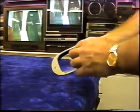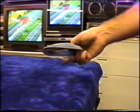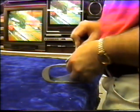And of course, I'll use the same Dremel tool and just Dremel out these areas. Now, I always have to be careful when I go through this plywood, so I can slit this with a zona saw first, so that it'll break out in one nice, neat piece. If you don't cut that plywood edge, it's really difficult to get through there.